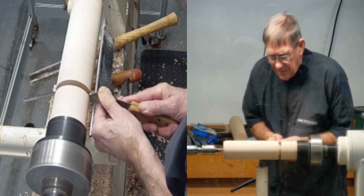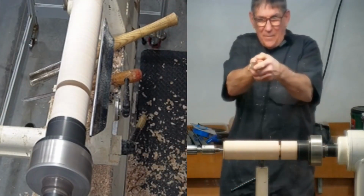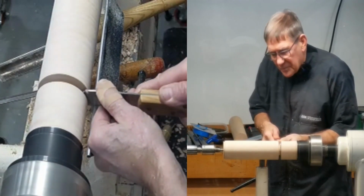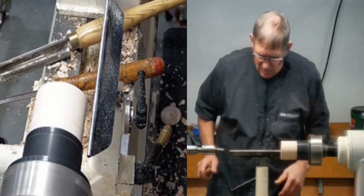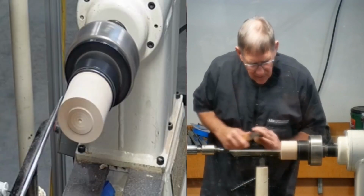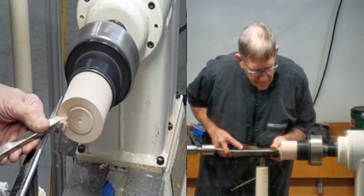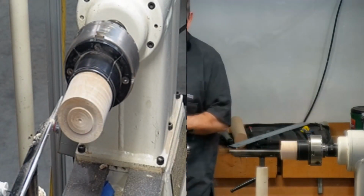So I'm using a thin parting tool. We're dancing with it. If we go straight in, all these sides get hot, burn, and cause friction, and cause a grab. While I'm here, I'm going to change this, give me a center so my drill runs in. And I'm going to square this surface up right here. Yeah, this one will work better.